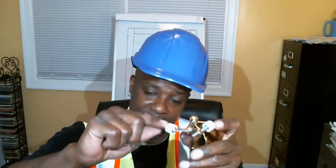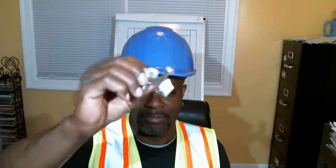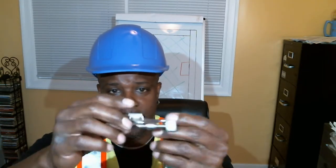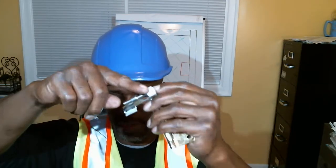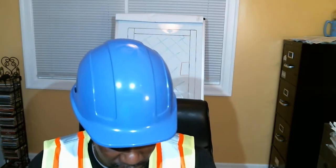But the same thing with this one here. When you get up to the very top of the door, you pass that 3/4 inch space. This makes a hole in the door. But a lot of people were putting this on at one time. So they decided to come up with another style and model that has a flat end on it. They figured they would use the flat end because it won't make a hole in the door anymore. And in some cases that is true. So you put that on the hinge itself again, and you adjust this flat part against the door, and this piece here goes against the trim. As they open and close the door, there's less chance for this flat piece to hit the door. But eventually, that's what I'm telling you, eventually it still will make a hole in the door, especially depending on how much force you put on the door.